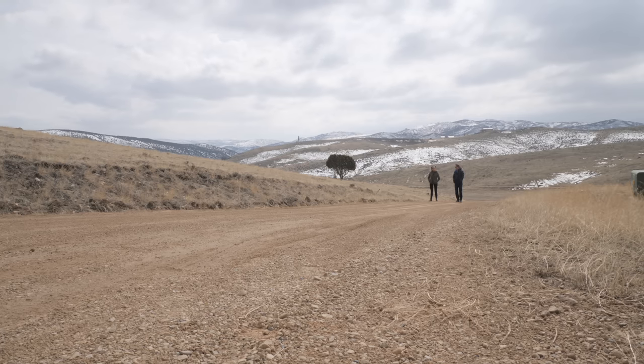If you're going to be working outdoors in the wide open, I wouldn't plan on getting the transmitter more than about 30 to 40 meters from the receiver, and try to keep them within line of sight — not, for example, clipped to the back of a person's belt. These struggle a little more than UHF systems when working outdoors in wide-open spaces, so just be aware of that.